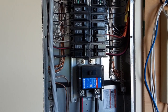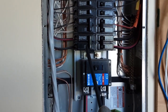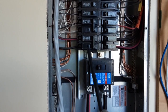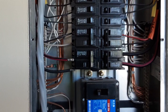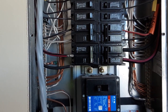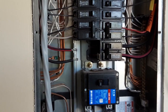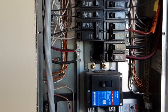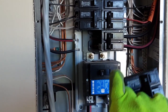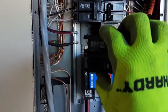As you can see, I'm going to be replacing this double pole circuit breaker and replacing it with the Eaton SPD. I've disconnected the two cables connected to the 30-amp double pole circuit breaker. Next step is to remove the circuit breaker. I've removed it — it was fairly easy. All you need to do is shut it off, then push it from the innermost side outward and rock it out — push this way and out.